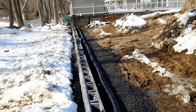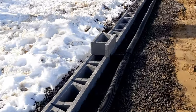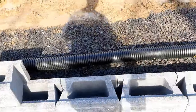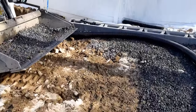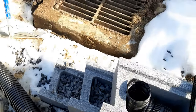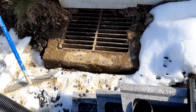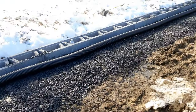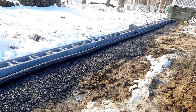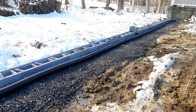Got the drainage pipe in. We have one discharge right here — it's going to come out through the face of the block. The other discharge is going to end up over here, and we'll fill that gap with some soil and rock so all the water will make it to that drain. Whatever doesn't come all the way down will exit through the front of the wall. These drains are supposed to be daylighted every 50 feet — ours are about every 40 feet.